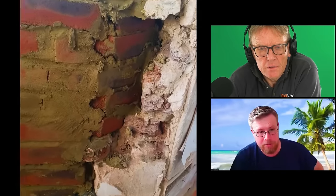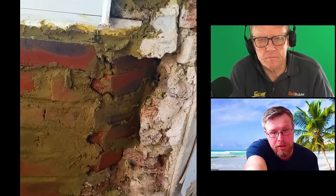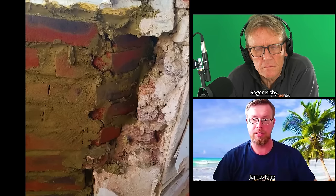The problem is on the inside too, because it looks as though the ground level outside is slightly higher than the inside floor level — about three or four inches below the pavement. I wonder where that underfloor ventilation is coming from, because she's got three grills in the floor. The air bricks might have been telescopic at one point. If you're bringing the damp course up two courses higher, you'll need to tuck something from that course into the house, down those bricks, down under the floor.